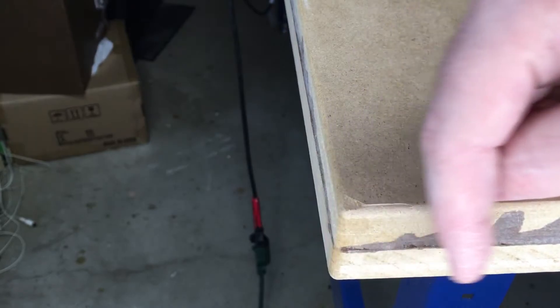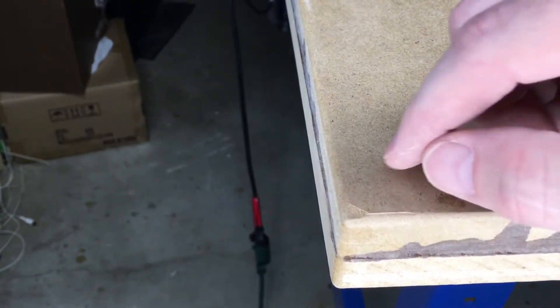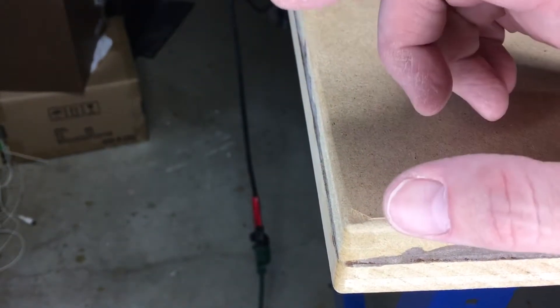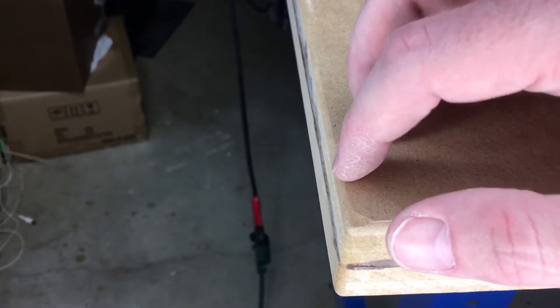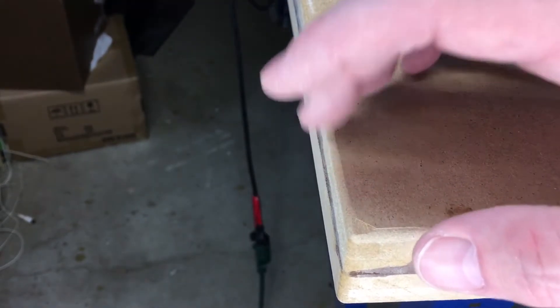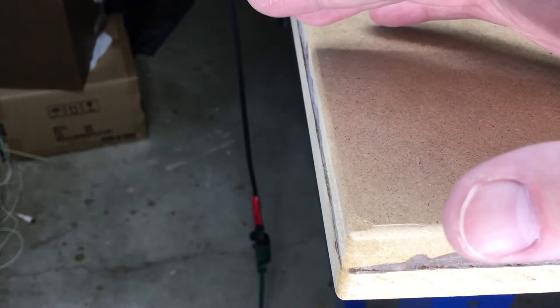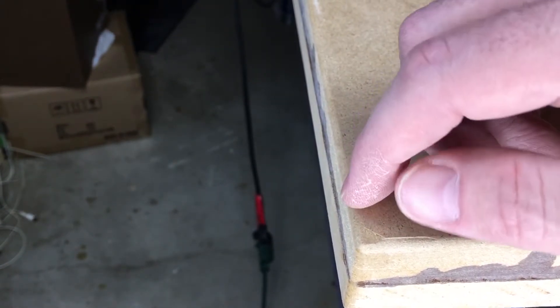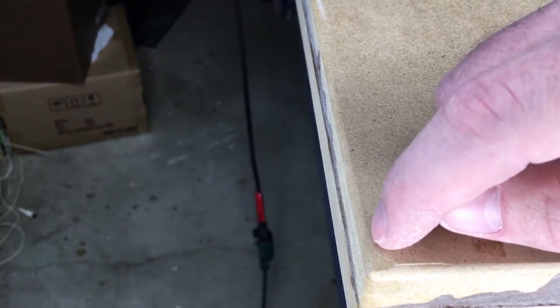Here's a close-up of the corner. I ran the router up this way first and then around the corner to have a nice bull nose. It looks like it chipped a little on that corner. It's a really good idea to round over the edges on MDF because they're not very strong and likely to chip anyway — are you going to love the look of chipped edges? I considered a bigger round over, but if I ever want to convert to hardwood edges I'd have to cut off more material. This way I'd only need to remove about an eighth of an inch.